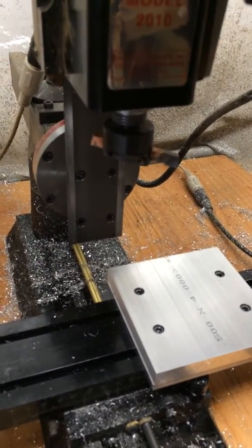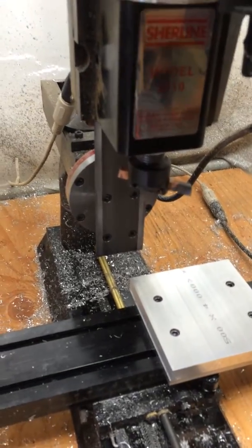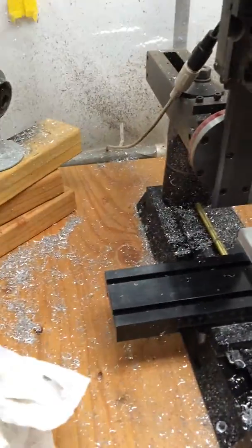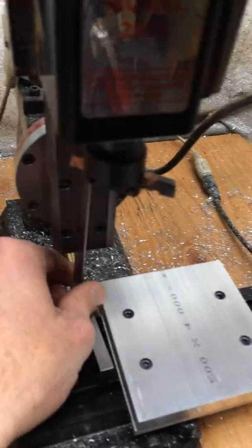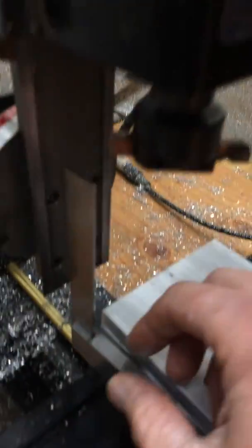However, because it's a wide arc, it's imperative that the machine is squared up as good as you can get. They call that tramming the machine when you're getting it squared up. The critical things are basically making sure the column is vertical.